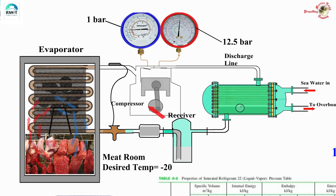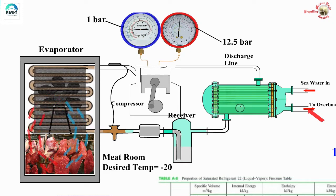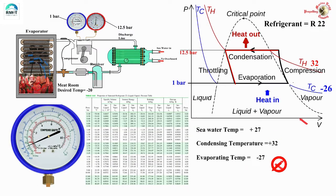The superheated freon then comes back to the fridge compressor and the cycle continues. In the condenser, seawater went inside the tubes — the cooling changed the state of freon from gas to liquid, and in the evaporator it changes from liquid to gas. Now let us look at this with the perspective of a P-V diagram. Here you can see the compression happening, then the condensation inside the condenser, then the drop in pressure — the throttling effect — and then the evaporation happening inside the evaporator, and the cycle continues.